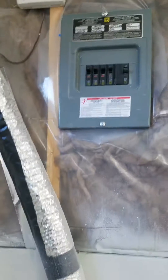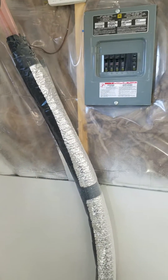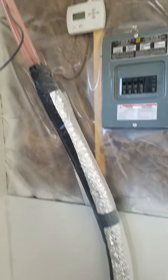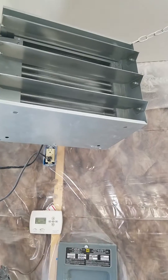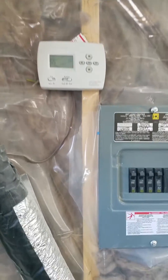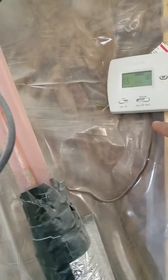I also trenched in my electrical power supply for my panel in the same pipe — which is not to code, but it's fine. Wrapped and insulated them really well. I've got a supply and return coming up here to this heat exchanger, which is basically like a radiator with a fan on the back of it.